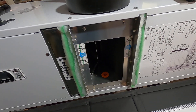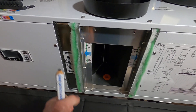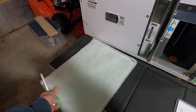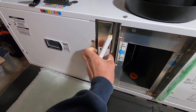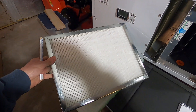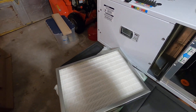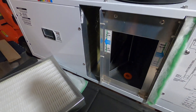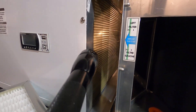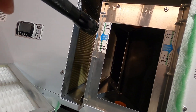We've also got some filters in here. I've got filters on both sides — these are both MERV 8. This MERV 8 looks like pretty standard stuff and it's in front of the MERV 15 filter, which is a much more expensive one. MERV stands for Minimum Efficiency Reporting Value. If you grab a flashlight you can actually see the coil back in there on the distribution side. The flapper is turned this way right now so we can't see the other coil.